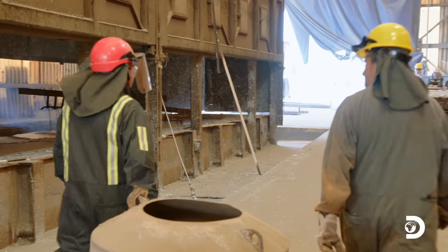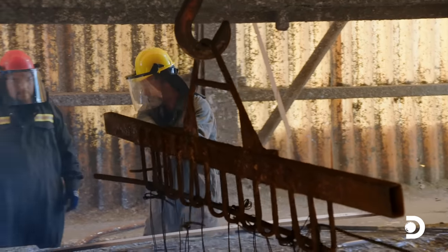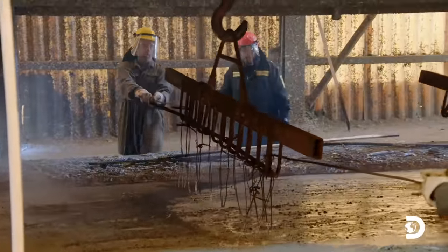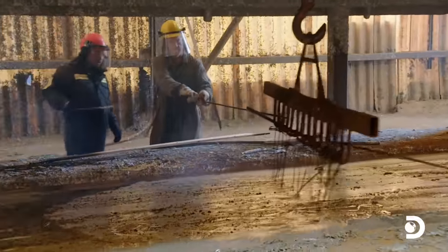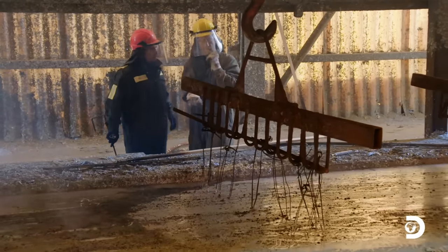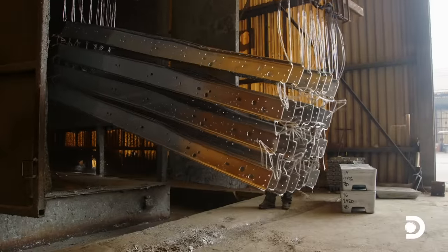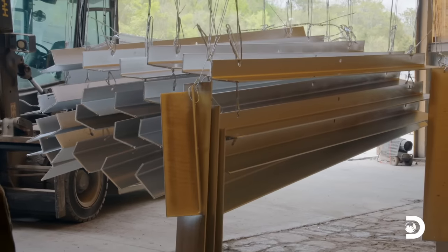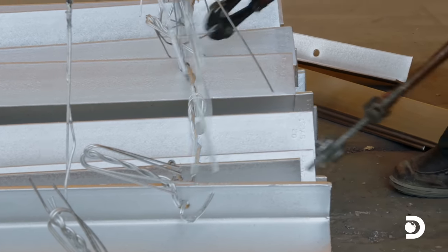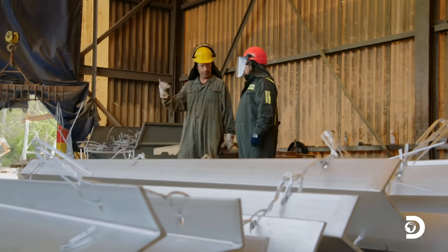All right, we're good to go. The parts stay in about five minutes or less. You use your hook right here and just keep pulling. The purpose of this shaking is to take all the dirt out — the more you shake, the cleaner they're going to come out. Once the items are coated with zinc, they're protected from the effects of corrosion. Now we have to cut the wires. This is going to cool for two or three hours, and then somebody's going to pick it up, stack it, and ship it.